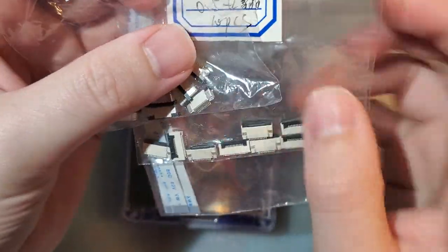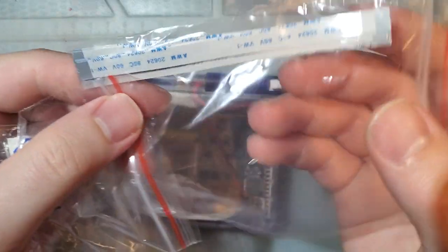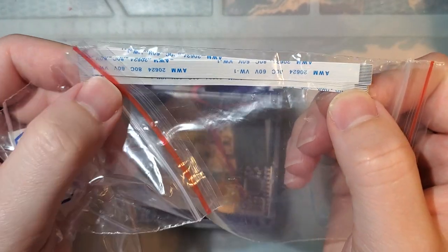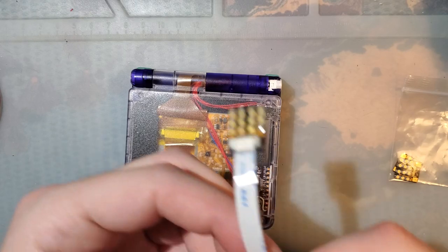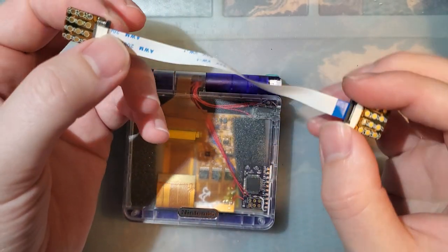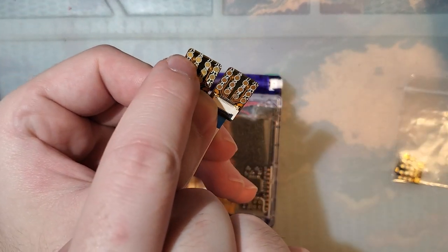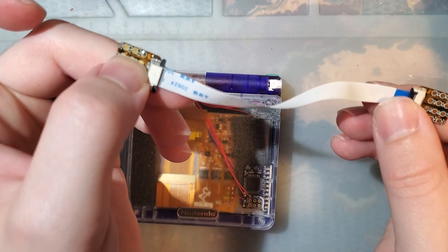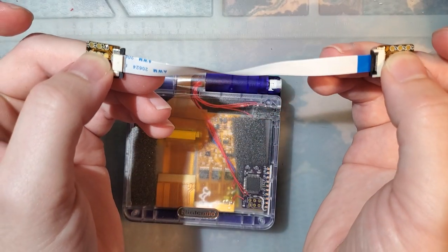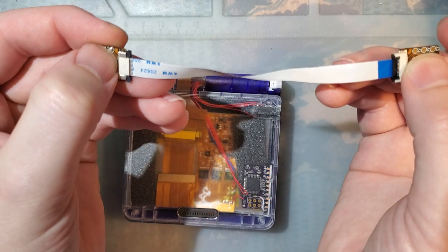But with one caveat, you have to use both up connecting and down connecting connectors if you're using one of these ribbon cables with the connectors on the same side. Otherwise, you have to use an opposite cable and then the same connectors. The reason for that is otherwise these will be facing the same way, the ribbon cable won't be twisted, and the wiring will be backwards. So pin 3, for instance, will correspond with pin 10, and so on. So you get top left connects to top right, top middle connects to top middle, so on and so forth.